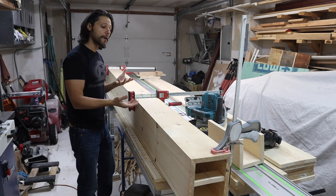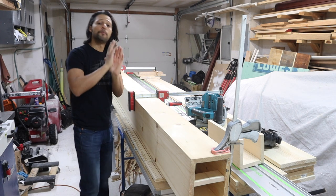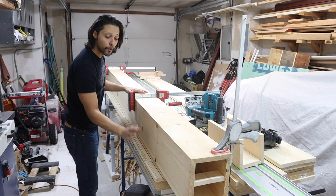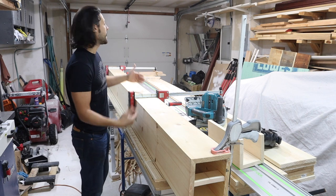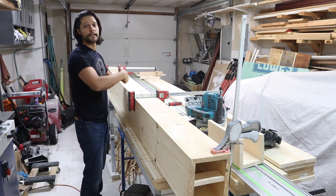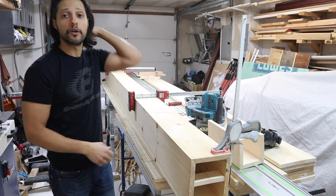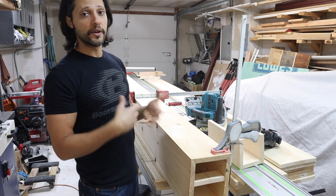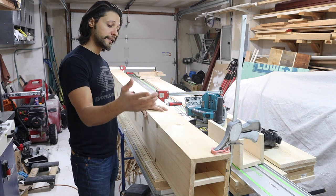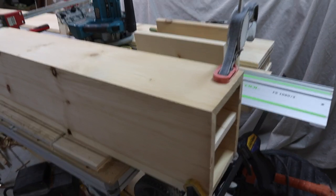What's really going to be difficult is just the sheer length of each one of these boards. Every time I make one of these beams and cut all the pieces, I'm going to have to stack them together, put them in the other side of the shop, come back, cut the next one, put it in the other side of the shop — until my workbench is completely clear. Then I can bring in one section of beams at a time, lay them all out, glue them up, tape the seams, roll them over, and pin them together with either 15 or 18 gauge brad nails.